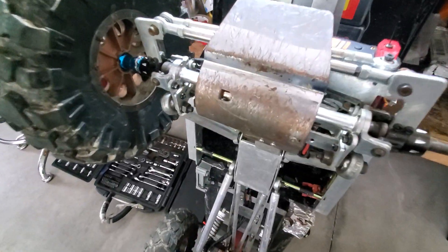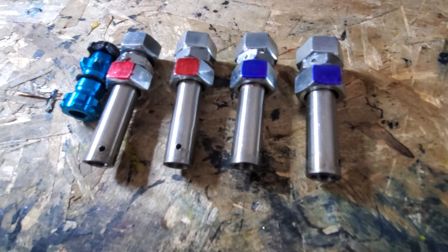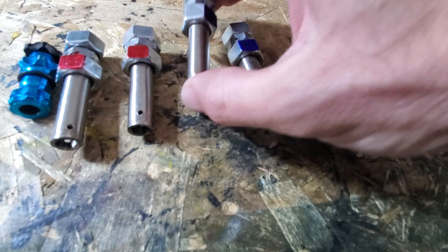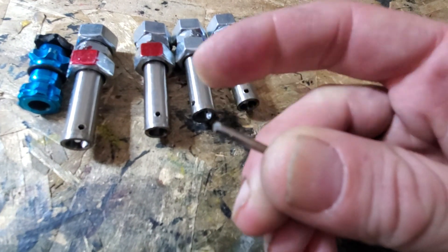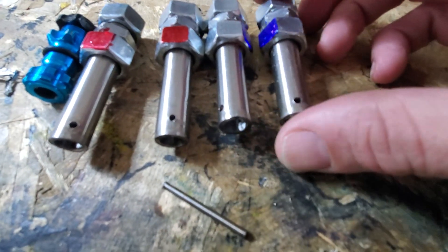Howdy crew, welcome! We are done with our axle extensions. I mentioned I broke the 2.5mm drill bit and had to wait till Friday. I got creative — took a 2mm drill bit, got in close with my eyes while drilling, pushed with two hands, and it punched through easier. Then I took the broken 2.5mm bit, ground it down to a rounded tip, sharpened it at the proper angle, and was able to punch 2.5 right through to make the holes bigger. Now the pin fits on at least one of them.